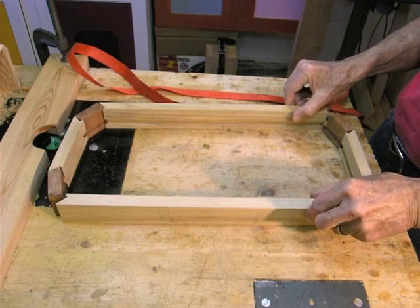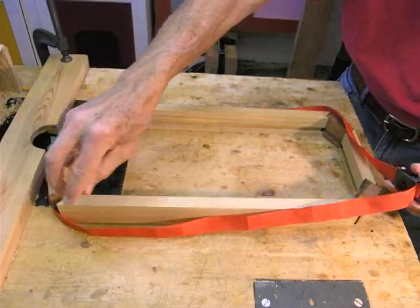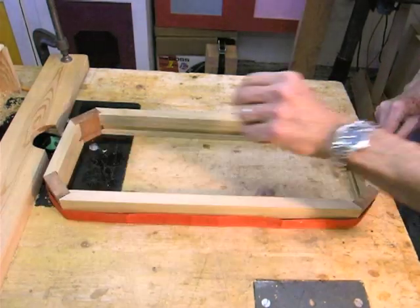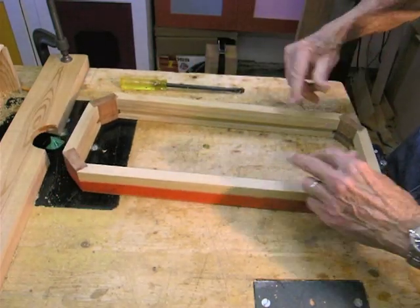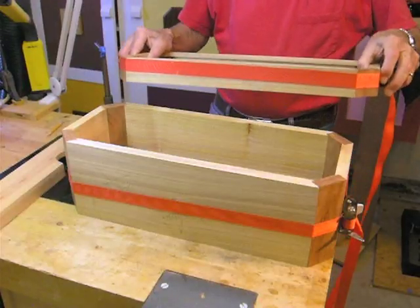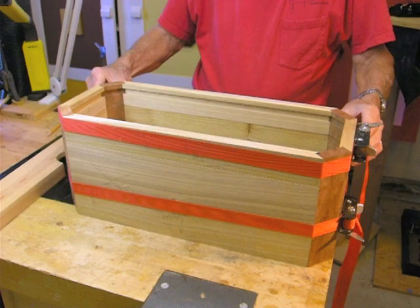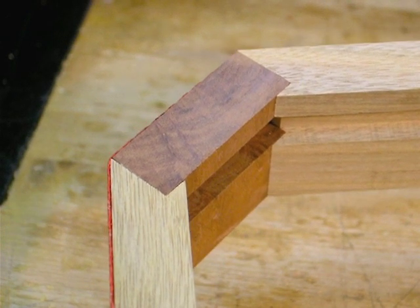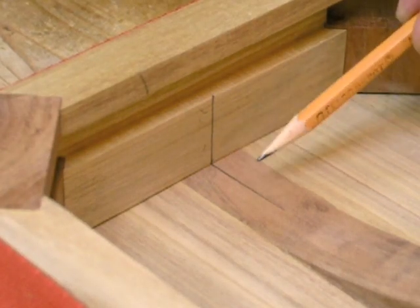Before going to shaping the top and bottom, let's take a closer look at the band clamping, using the lid as a more easily seen example. Here's the dry assembled lid frame. As you can see, the lid fits the body assembly very nicely and with very little tinkering. I'll use the lid to trace the top and bottom shapes. Here is a close-up of a couple of the lid joints and the slot for the top piece. I have marked the center line of the top and also the center points of the ends of the lid frame. When these are lined up, the handle is centered in the lid.